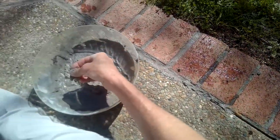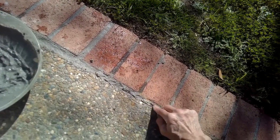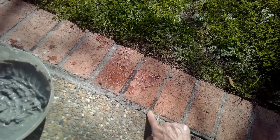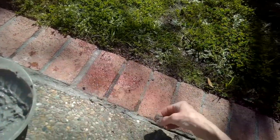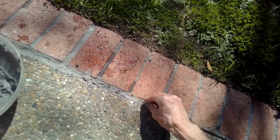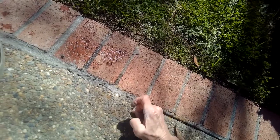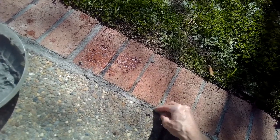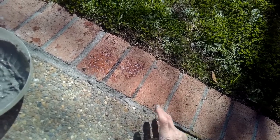Right now the initial treatment here looks a bit lumpy and inconsistent, but this is just to start to fill the gaps. I'll use my finger to smooth it out initially and finish it with my finger and some water or the moist sponge to get it smoother. This is just the preliminary step — just feeding it in. If you have a depression where a stone came out, you can add a little bit of your mortar mix into there too and then smooth it out later.